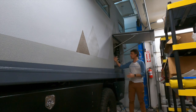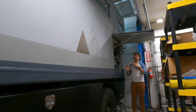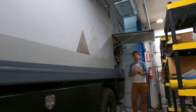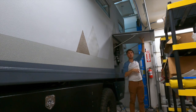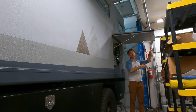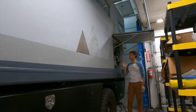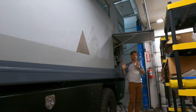I could have sped this up by going with a shorter actuator mounted more centrally, which would have made it open and close much quicker. But I wasn't sure exactly how much sealing force that would create at the bottom. I really wanted to make sure it was well sealed at the bottom — hence why I wanted these to pull it more lower down, so I went with the longer actuator. It did slow it down, but it's also a geometry equation to make sure they open as close to 90 degrees as possible with a slight angle so any water on the wall drains off the top of the door instead of falling into the garage space.